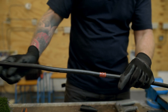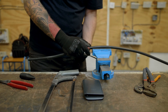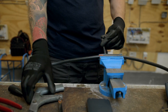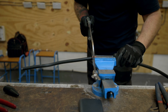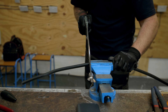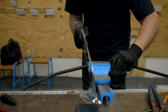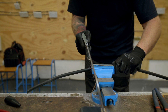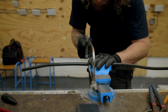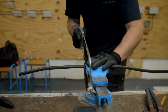Leave the armouring to actually go around the outside of the shroud and make a good solid connection. I'm going to put it in the vice — just because we're in a training centre, let's be nice and safe. If you have your own spinner rather than a hacksaw, you can use your spinner opposed to a hacksaw. So just a back and forth — I don't want to go all the way through, just spin it as I go. You're literally just scoring the armouring, about four or five strokes, and then spin it. Just to score it, keep going round all the way round. You're allowed to use a spinner for your exam — that's just a tool to go round rather than use the hacksaw. I prefer a hacksaw myself.